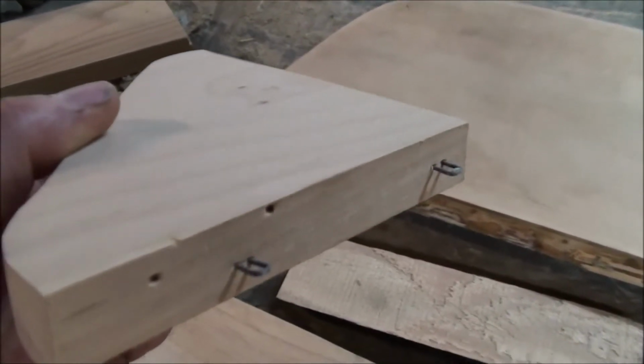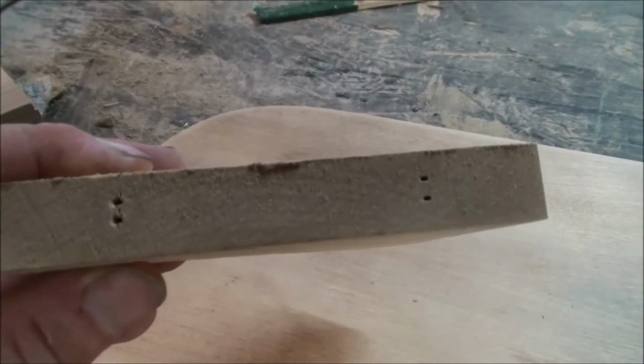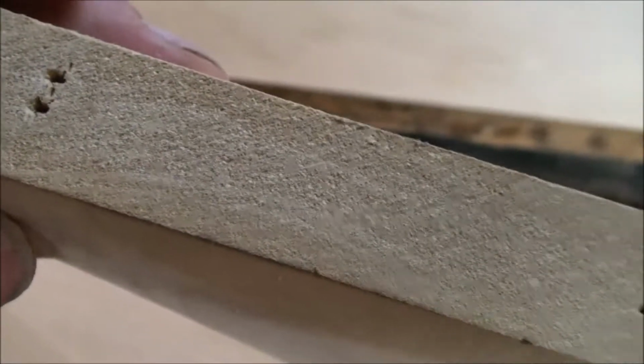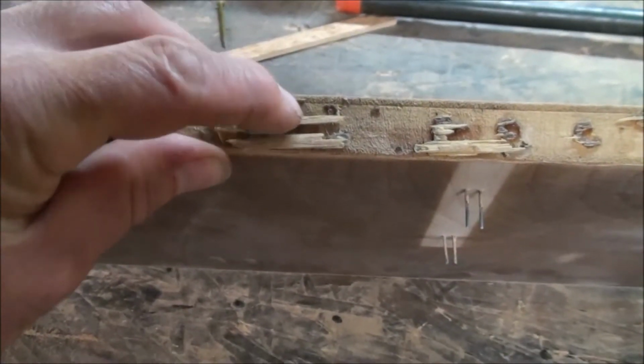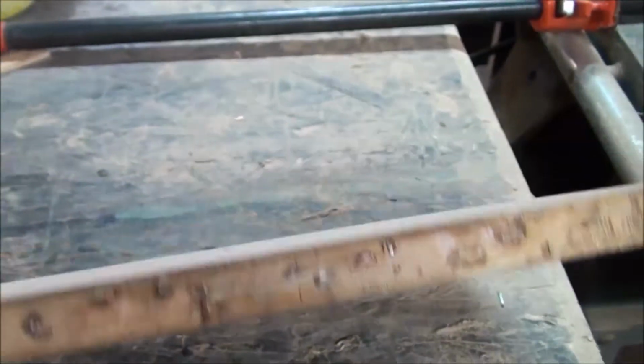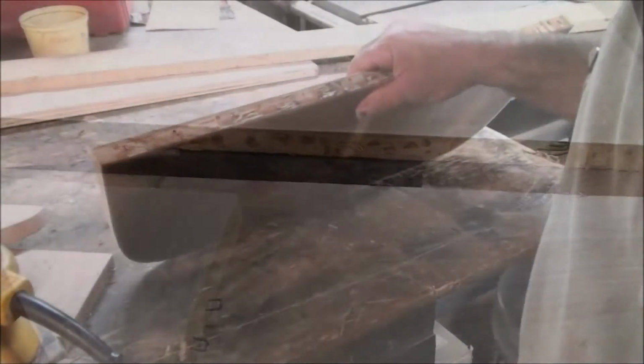So I'll have to pull the staples out of here. I'll keep those staples in place, and I will use whichever one of these looks like this one here used to go under this shelf. So I'll reinsert those staples here, and I'm going to go ahead and glue it. They didn't glue it before, really isn't necessary, but I'm going to glue it anyway just to give it some extra security. But anyways, I'll run these staples out of here, clean up this edge, and then clean up that dado over there, and make this thing ready to take a stain.